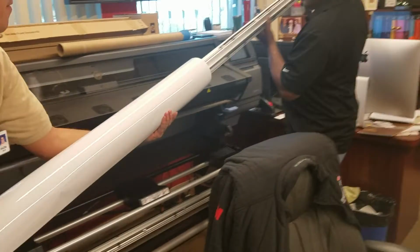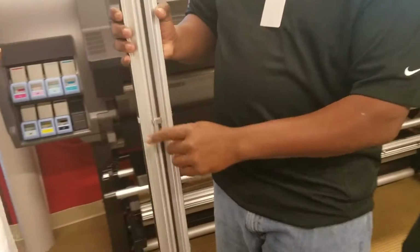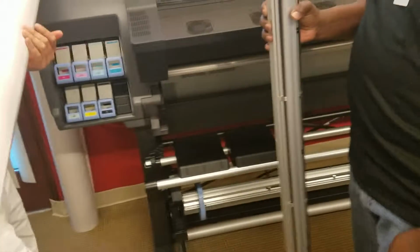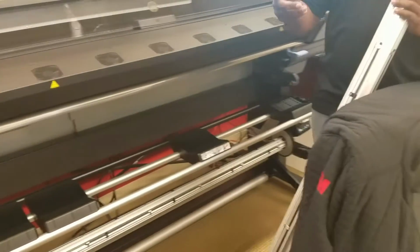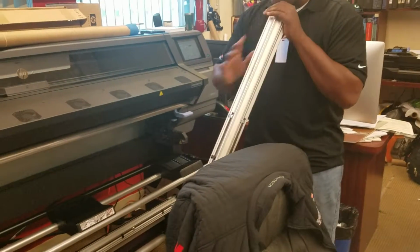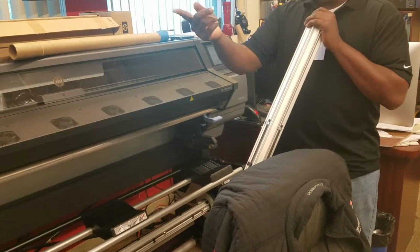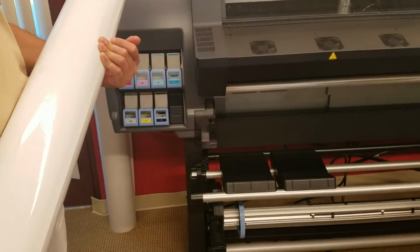There we go. You have these tension straps on this spindle here, which prevent this core from just spinning around. That's what gives it its tightness there. So this media feeds in a particular way. Whenever I put this on the bed, I'm always thinking, especially if I'm using better material and all that good stuff, I hate putting it on the bed and all of a sudden realizing I put it on backwards. So if you just know that the media, the printable media, is always facing up.